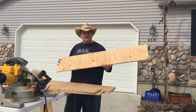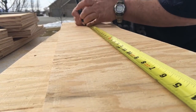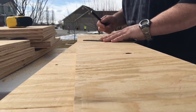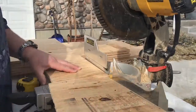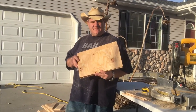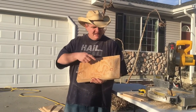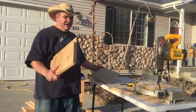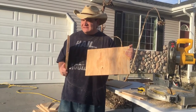I take my ten-inch strips and my eight-inch strips and I cut them into thirds — they'll all be sixteen inches long. We cut every one of the strips of plywood into sixteen-inch pieces. This is what will be used for one nesting box; the rest are all there in a pile. The sides still need the angle piece cut out — this is a twenty-eight degree angle. This piece is the bottom. This becomes the back and the top; we divide it in half — a nine-inch piece and whatever is left, about seven inches, becomes the top.